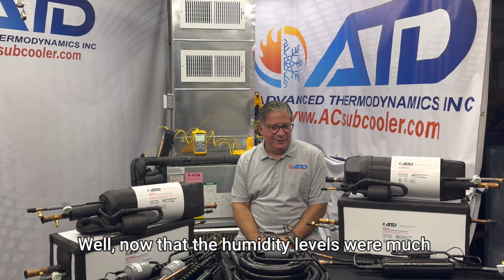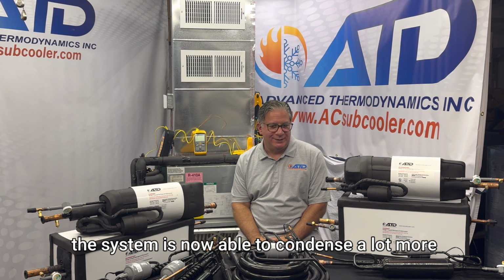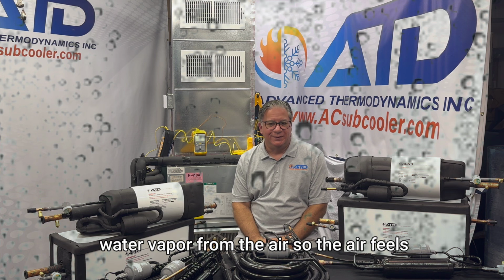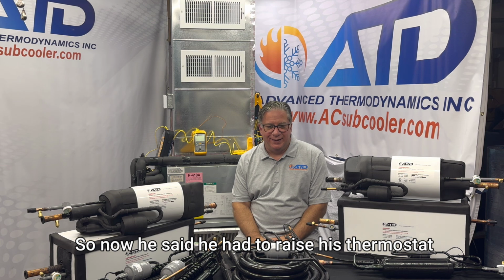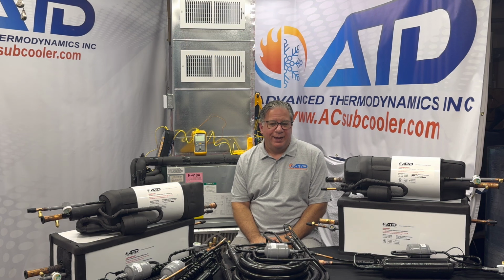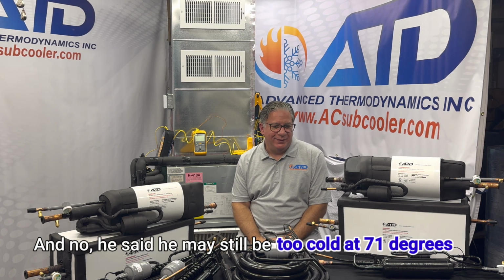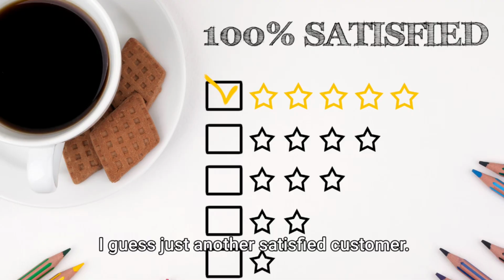Well, now that the humidity levels were much lower in his home from subcooling the liquid refrigerant, the system is now able to condense a lot more water vapor from the air, so the air feels cooler to the skin. So now he said he had to raise his thermostat to 71 degrees in the heat of the summer. And note, he said he may still be too cold at 71 degrees. I guess just another satisfied customer.